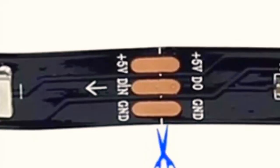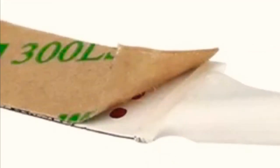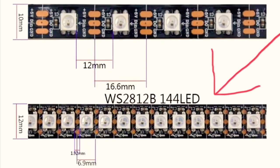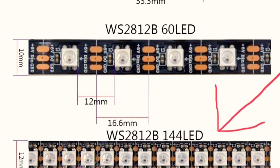Now these are the LED strips. You can cut these — I'll show you — cut it right in the middle and you can use either side. They have power and ground, and they even have sticky tape right behind to set them in place in the logo. You want to order the LEDs at the bottom, not the top ones, because the top ones have big gaps.